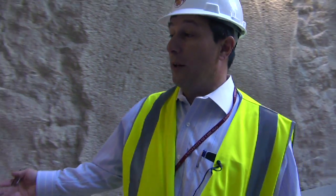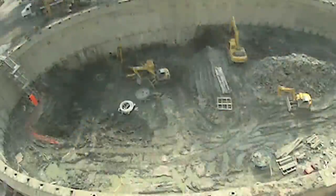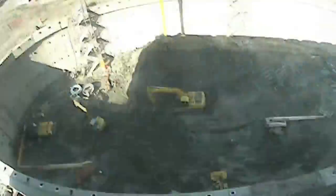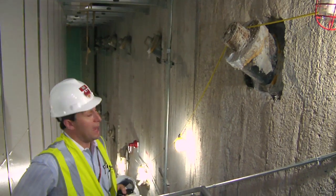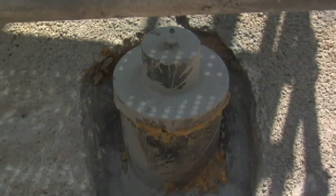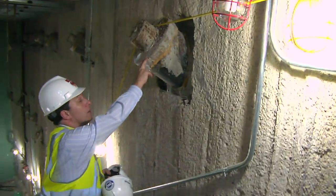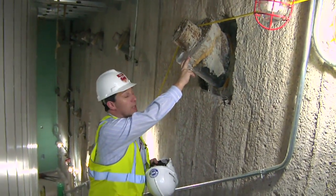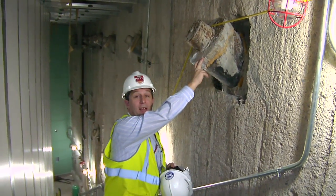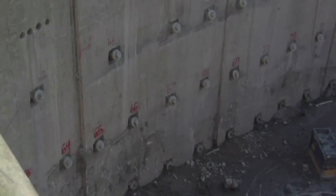The next process in the slurry wall is, once we get the perimeter all set, we start the excavation of the hole. As we're digging the excavation, we get down to basically four levels. We have four levels of what we call tiebacks. The purpose of these tiebacks is to hold up the wall. They're grouted in place and post-tensioned to ensure that the anchor will stay in place. We have approximately 300 of these tiebacks, mounted on 45-degree angles, approximately 45 to 65 feet in length, and they all stretch all the way around the perimeter of the project.